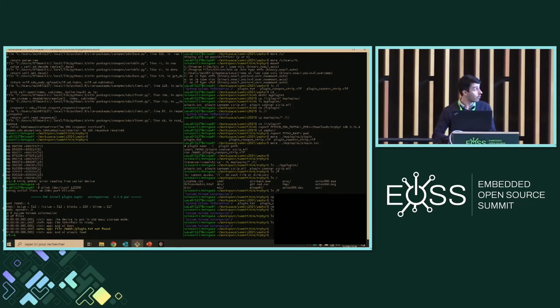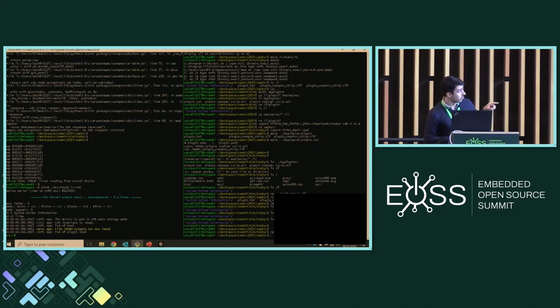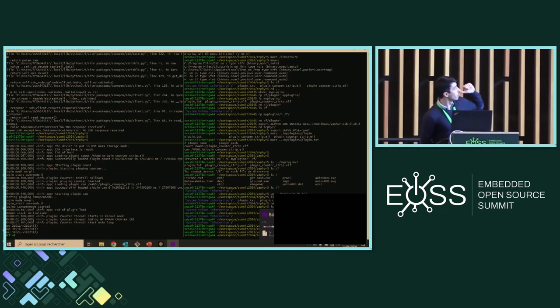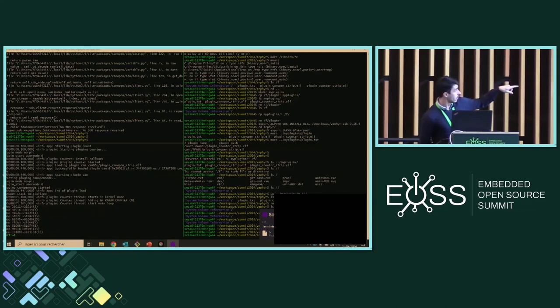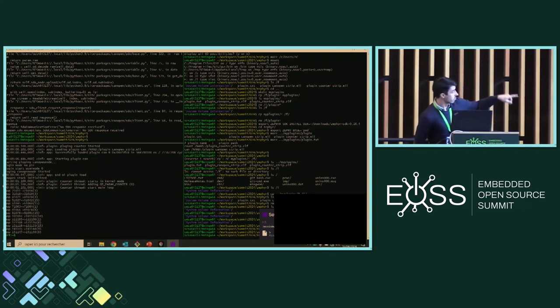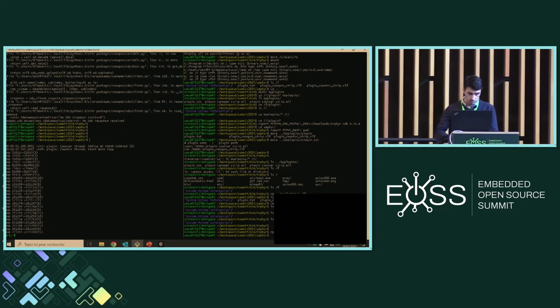So now, on the right, I'm copying the extension file plus the configuration file to the target. Now if I restart it, it will be fast, but as I showed you a few minutes ago, you can see that now the two plugins are loaded and the CAN stack is started. You can see starting plugin CAN open node. And you can see that it's printing that there is a loop on the CAN which is waiting. And starting the pattern now.